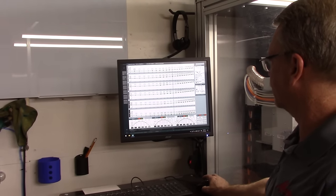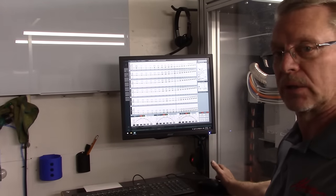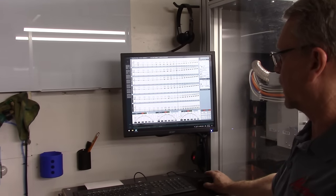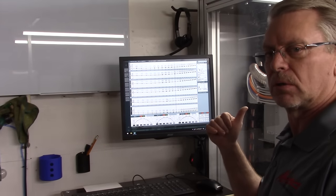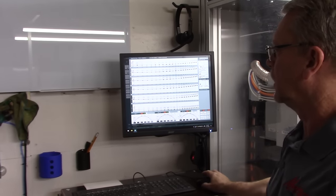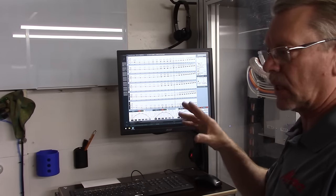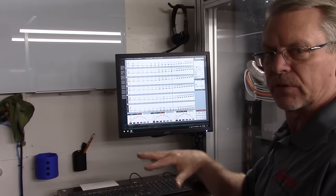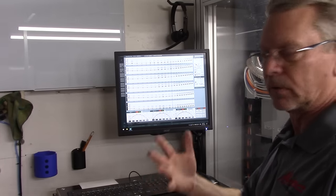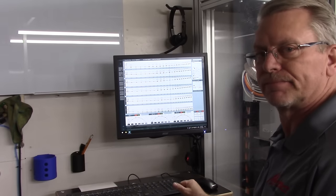Cool. And that's it. If we were going to do the nut, if it needed it, we would follow it at this time. We would take this guitar off. If this was like a retail guitar coming in for servicing, we would take the guitar out, reset it up and set the action, set the intonation, set everything exactly how it's supposed to be for best playability to go along with the work that the machine just did.